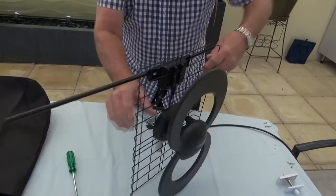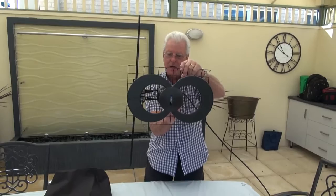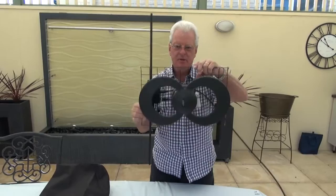There you have the antenna in its horizontal mode. If you release this and turn it that way, it's in its vertical mode. However, this is the VHF element — there's no VHF in vertical mode in the cities, so you will never have it in this mode in a capital city. In the country there is both vertical and horizontal, so that's horizontal and that's vertical.